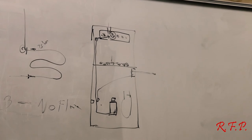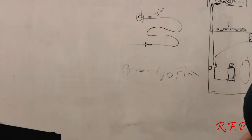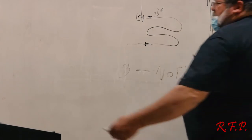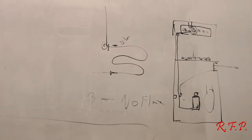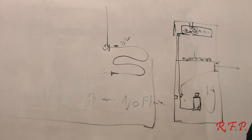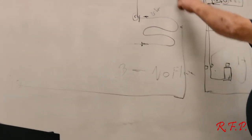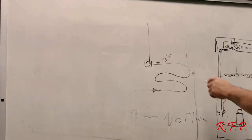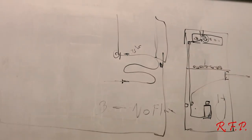They had changed, and this is something I've run across with furnaces. I told you it's got to have a good earth ground. Back in the day, your water line coming in from the street was some kind of metal, galvanized iron, going through the ground. Well, guess what? They already had a ground rod right there. You just tie on to the water plumbing with your ground from your breaker panel, you ground your breaker panel to the water pipe, you got a ground.